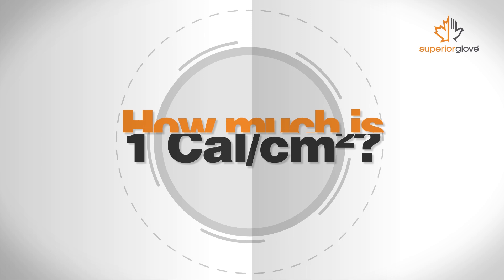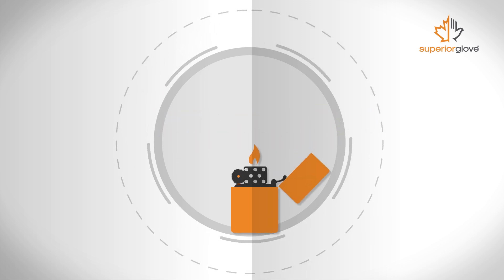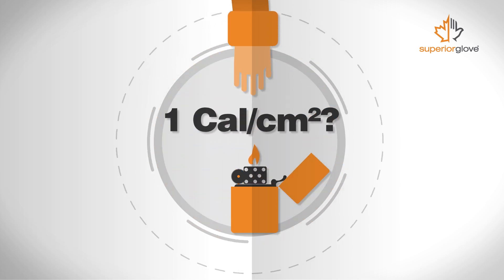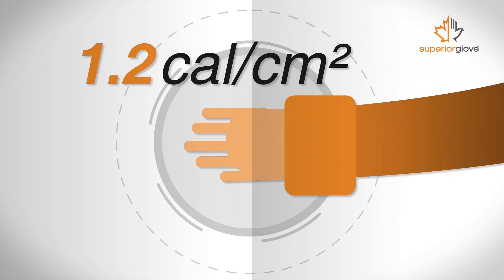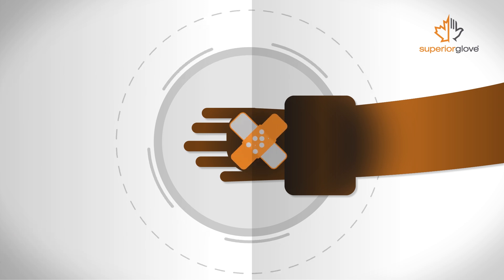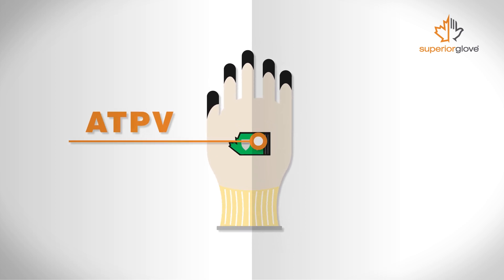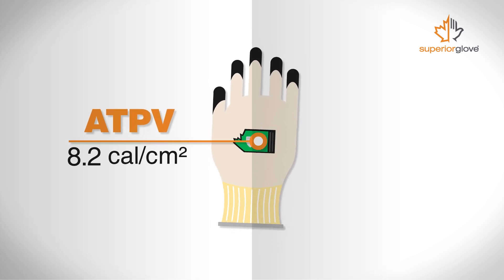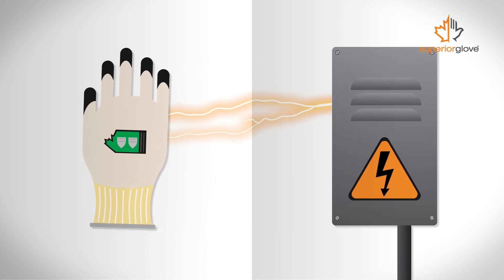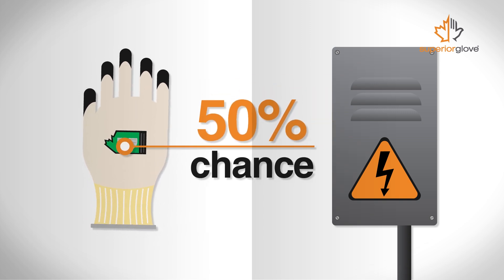But how much is one calorie per centimeter squared? If you were to hold your finger directly over the flame of a lighter for one second, that's one calorie per centimeter squared. It takes 1.2 calories per centimeter squared to create a second-degree burn — meaning red, blistered, and swollen skin. So, let's say you have a glove with an ATPV of 8.2 calories per centimeter squared. That means if the arc flash's incident energy is 8.2 calories per centimeter squared, you have a 50% chance of getting a second-degree burn.